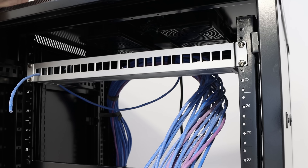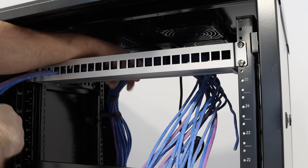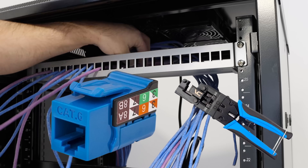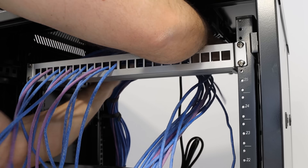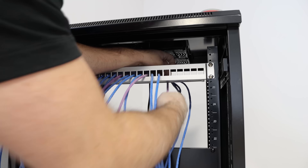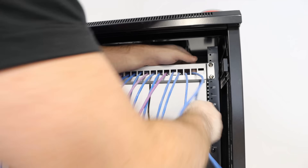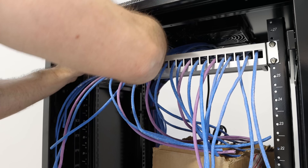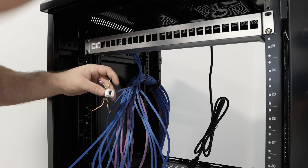At this part of the job, I'm putting the Cat6 cable through the keystone slots of our patch panel. I'm going to be marking off the back with a Sharpie so that I know where I'm going to be cutting the cabling so that it fits perfectly. We do use the Vertical Cable V-Max jacks as well as the eye punch tool to crimp these, and those will also be in the description below.